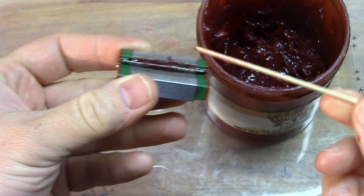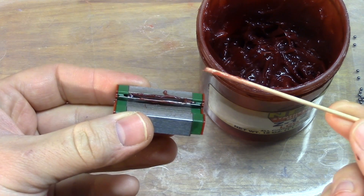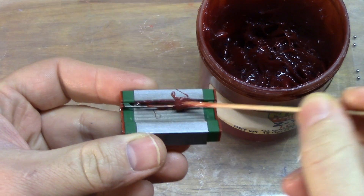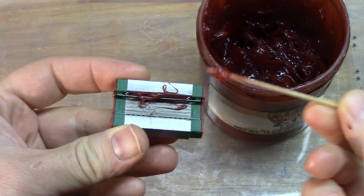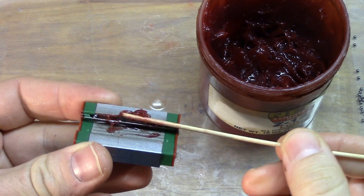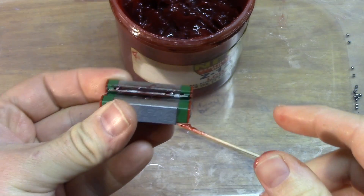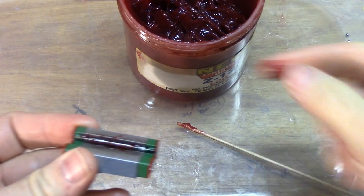Take a little bit of grease and apply it to the back. Watch your stick as well, because the ball bearings will stick to the grease and might come out with you — you don't want to dip them into your pot. I'm not too worried about applying too much grease here because this is actually going to squeeze the excess out, so it's really hard to overdo this. Once you have the channel greased up, we can start putting the balls back in.